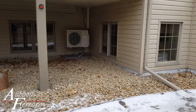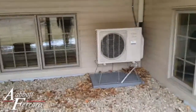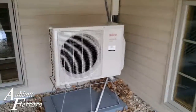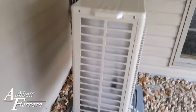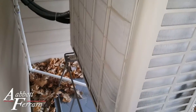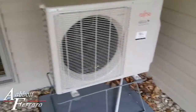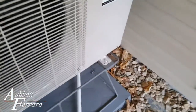Here's the outdoor unit, and it's actually running in heat pump mode right now. It's about 30 degrees out today. The unit's getting frost on it — this is kind of not common to see. It takes certain temperature and humidity to form frost. The moisture in the air is clinging to the coil, so this will start going into defrost to get rid of that. You don't see it very often. So yeah, this unit's running and it's heating right now, and the air coming out of here is pretty cold.